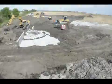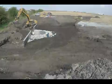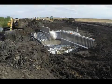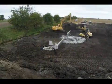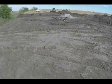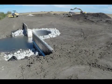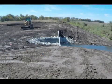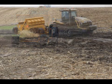All of the support structure disappears below ground as soil is backfilled over the rock. As workers move earth around the structure, the channel is opened from the drainage ditch and the water flows in — we now have a new stabilized path for stormwater to flow into the ditch. The next step is to grade the area to create the dam, which will direct water into the structure and blend to the elevation of the grassed waterway. The auxiliary spillways are shaped, and earth work for the grassed waterway is finished.